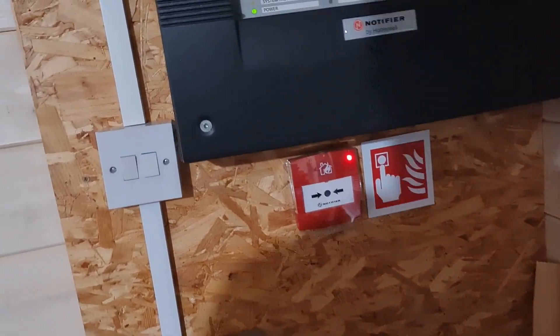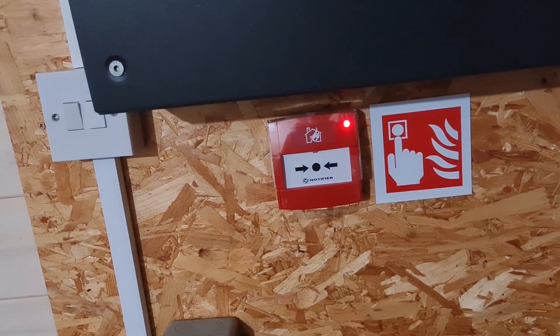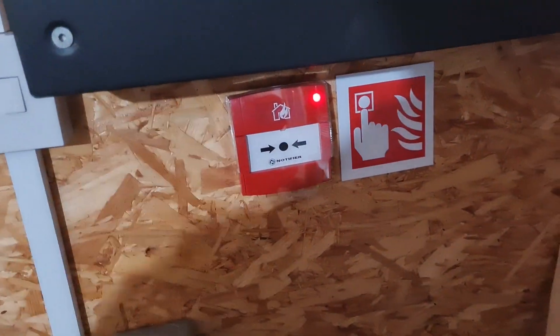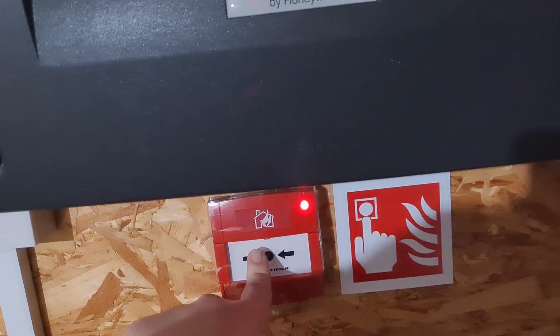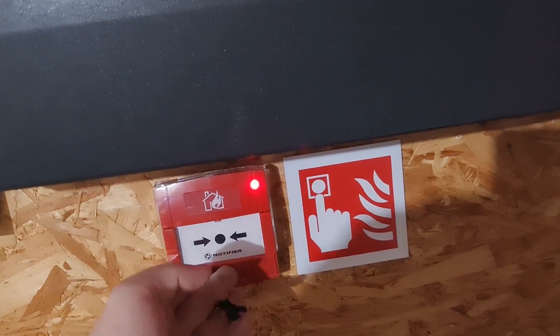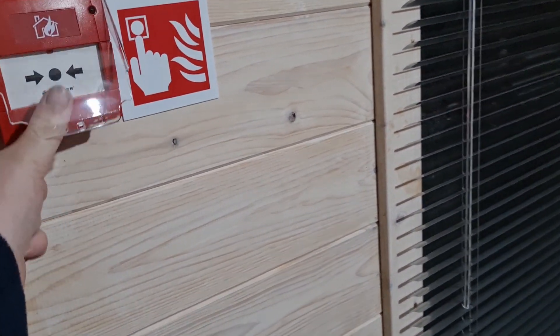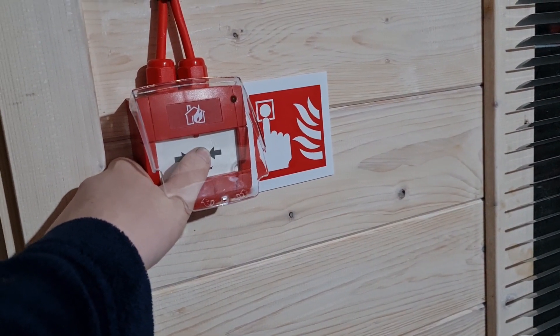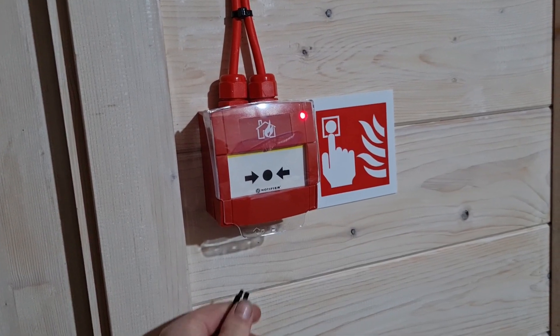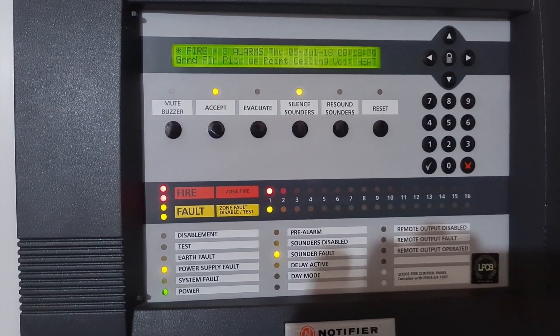I still don't know what's going on with this, I'll fix it. I know what happened - I took all the modules off so that I could put the new sounder on, which is partly why I couldn't be bothered because it was a lot of effort. I took all of them off and then realized I couldn't be bothered, so I just re-did the bells and didn't redo the call point modules. This call point is on that loop, which is why this call point isn't affected, which is why we'll test it now and demonstrate the speed of Notifier. We'll reset now.